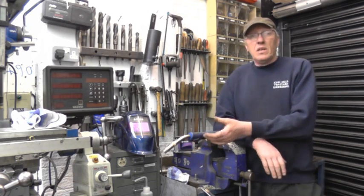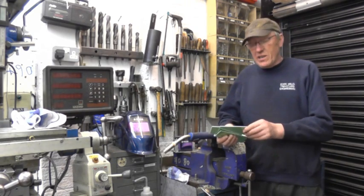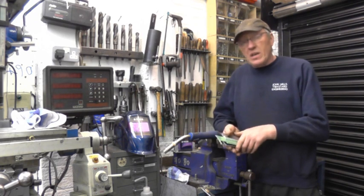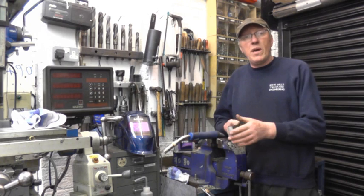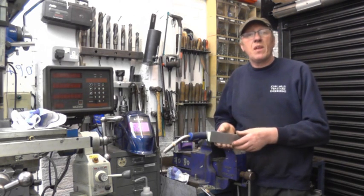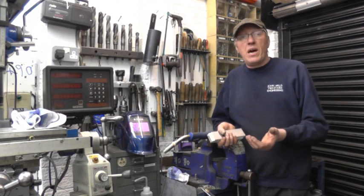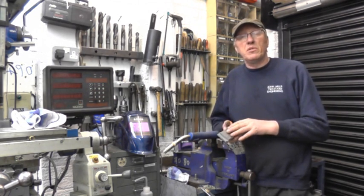Aluminium welding. I've got some samples Artec sent up from 1mm to 6mm thick. I'll be using the machine on a 30 amp supply, using 1mm wire until I get to the 6mm. Then above the 6mm I've got some half inch and some 3 quarter plates. I'll be putting 1.2mm wire in, putting it onto the heavy supply and turning things up to see exactly what the machine's capable of doing.